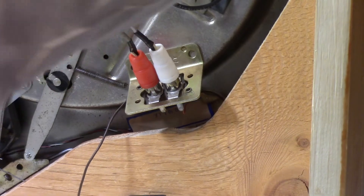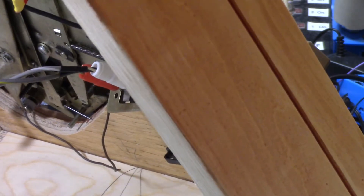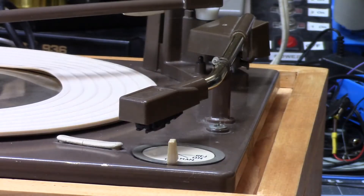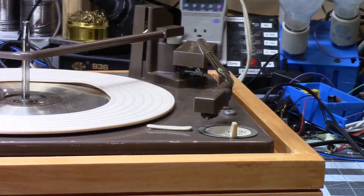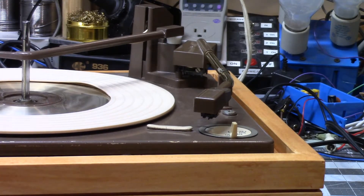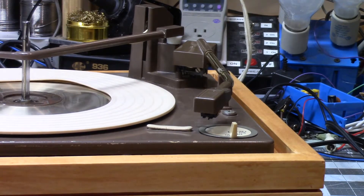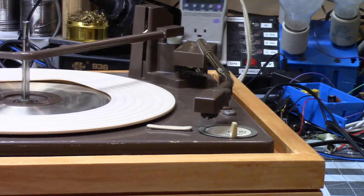So the next thing I did was check the shielding. One of the key parts to dealing with hum is shielding, and one of the problem areas is the metal in this tone arm. While I had the cartridge grounded to the chassis, I could handle the arm without causing any hum. Some tone arms — when you grab them you can actually hear a hum caused by you grabbing it.